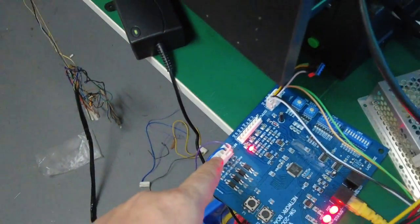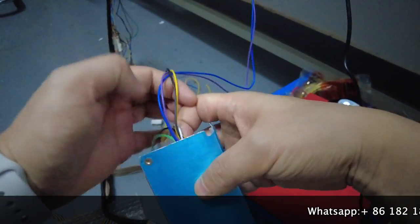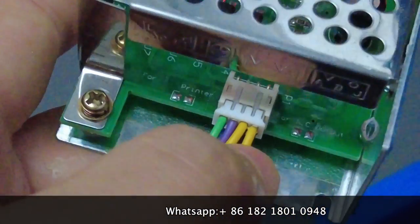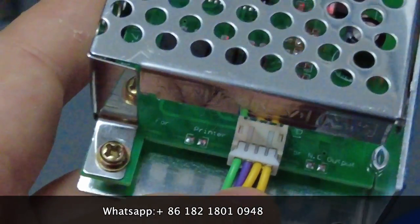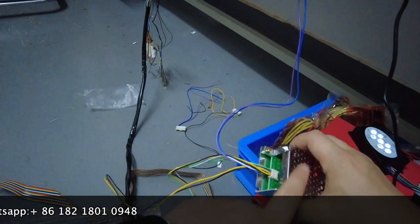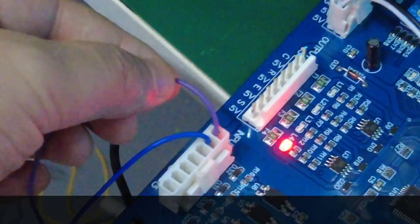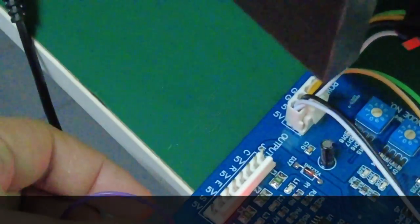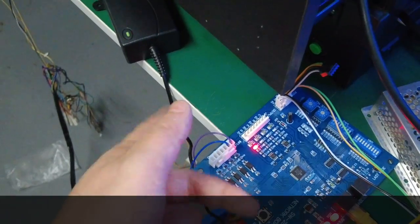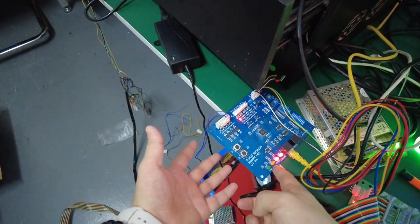The purple cable is the third cable from the silver boxes end. At the flagging board, the purple cable goes to the first position. If the harness in your hand does not have the purple cable in the first position, you need to cut the wire and reconnect it. That's how you connect the flagging boards.